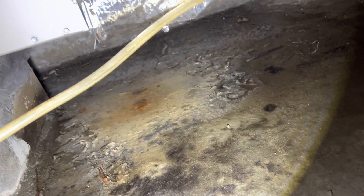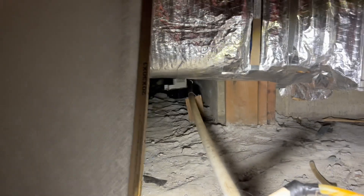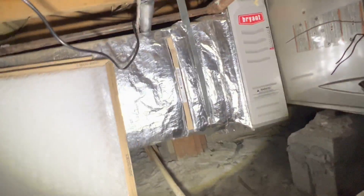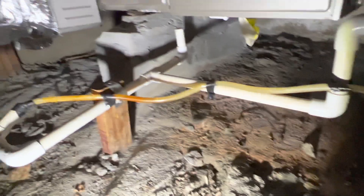Back at that same house with the Carrier pressure switch. This unit has just been dripping into the crawl space. I blew out the drain line and it's slowing down — it'll stop eventually. The drain line was clogged. There's also a 120V condensate pump over there that is no longer discharging and is filling with water, so we're going to go ahead and replace that and replace the disposable filters on both units.